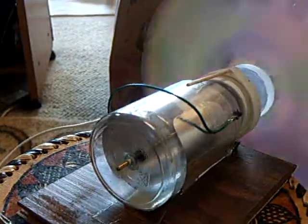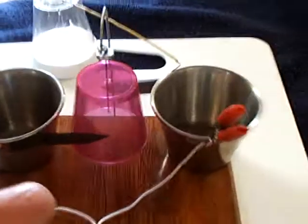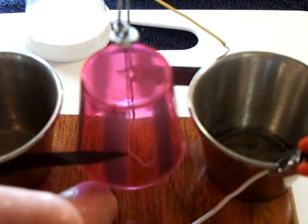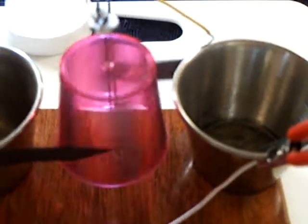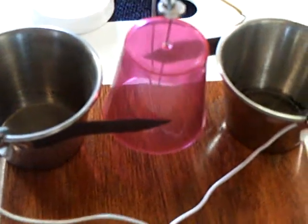That's the Voss electrostatic generator — Voss type generator. That's just a plastic garden windmill blade, and that's just a little 110 fan blowing at it there. It runs this along this little tiny wire just fine and runs that motor. This is the motor that's got the graphite pencil lead segments and the cellophane tape with carbon graphite powder on the sticky part of the tape.